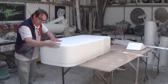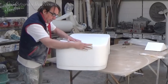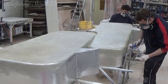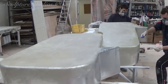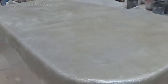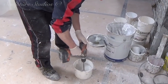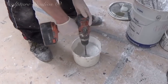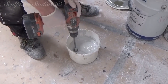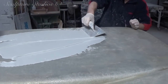Once all the shapes are cut, the edges are softened using a sandpaper or a sanding block, and we go over with our sticky back tin foil. This will protect the polystyrene from the resin and fibreglass going on top, which is only going to be built up in a thin layer in this case, just for a bit of added strength. This doesn't need to be a heavy duty layer, as this is going to be out of arms reach for a one day event. This whole process, which we call a blanket coat of glass fibre, is often used when a mould isn't cost effective, we don't need to duplicate the piece several times over, and the quality of the piece can be achieved from going straight on with glass fibre and working up the finish.